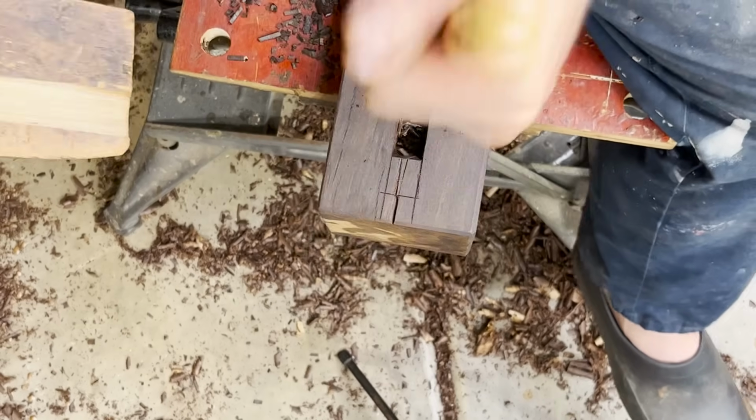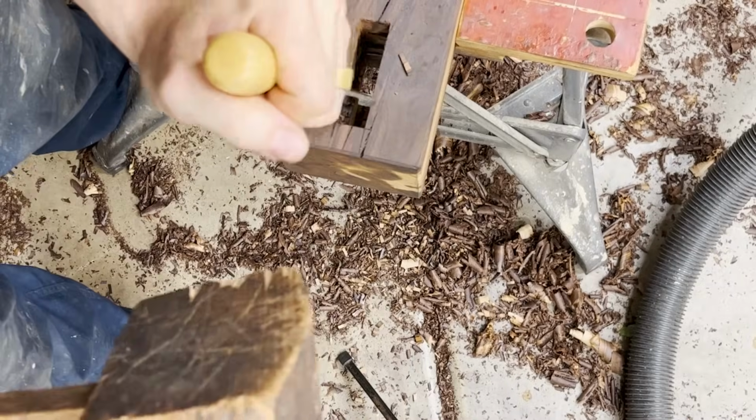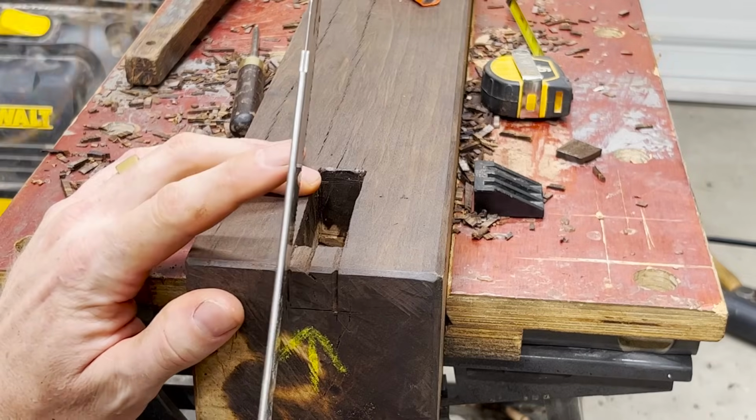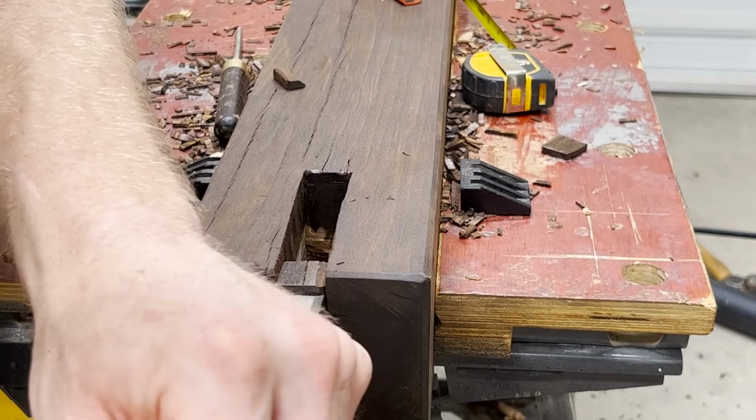I prefer a traditional method. By cutting straight into the material with a chisel every 16th to an eighth of an inch or so, the chisel naturally creates a deep slope cut that goes through more than half of the leg. Then I flip it over and do the other side where I meet into the previous cut.